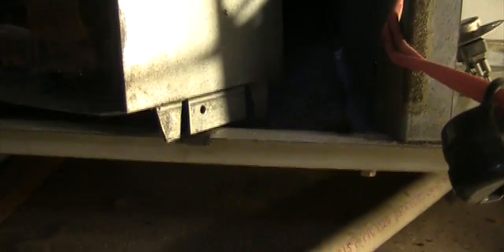Okay, after I remove the top 2 screws, it's still holding on, and the reason for that is you have 2 tabs here, which go on the motherboard. And that's 2 tabs right there. And also that's 1 screw here holding on it. So just be aware of that. That's a tab, nothing to do, but the screw is holding it. And now the motherboard is out.